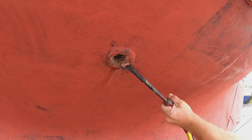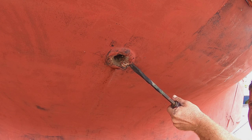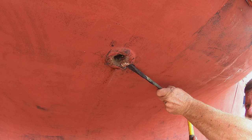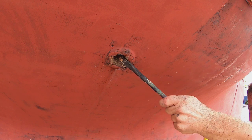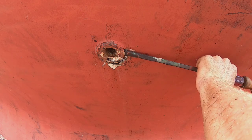Then I'm going to take a flathead screwdriver — you could use a chisel and a hammer — and get underneath it on the outside and gradually begin bending that segment inward, as I'm doing right now. You can see it's bending, so just keep hammering there. Once you bend it enough, that part of the outside flange will just break off. Then you move on to the next segment. In a few cases I had to hammer it inward and then back and then inward again — bending it back and forth a couple of times before the segment would actually break off.